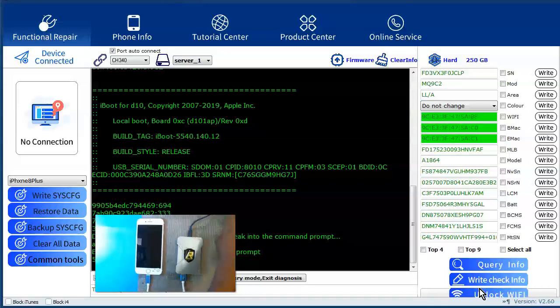So the only thing you really have to do with a WiFi problem is just take the chip off and put another one on. I still feel like it's a pretty strenuous and long task, but it's very doable — it's just another repair you can add to your arsenal. I'm going to pause this real quick and see if I can get this thing up and running in DFU mode.